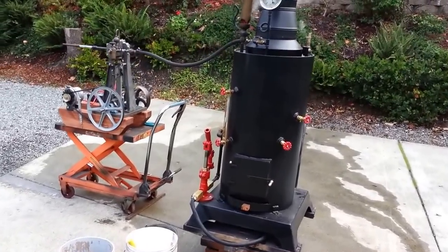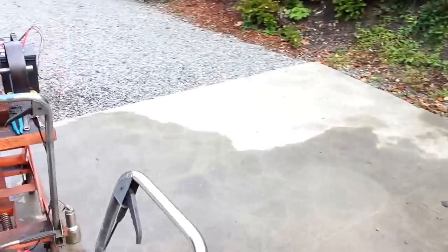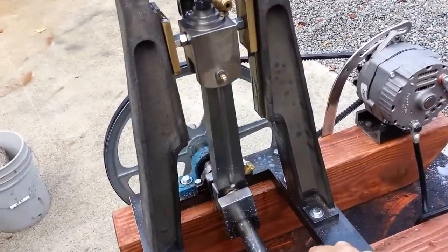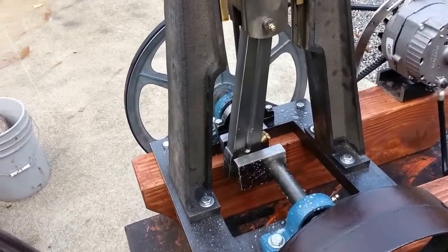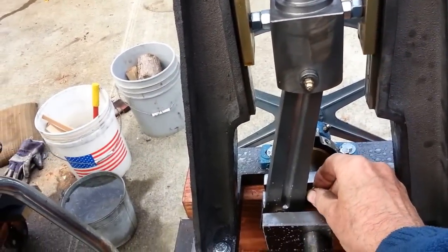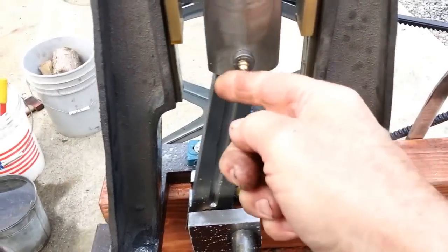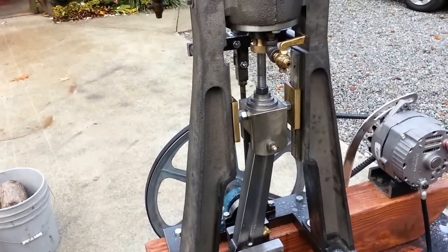Okay Alan, I'm running the engine off the boiler and just going over a couple things on the engine. The single-cylinder engines start best if the crank is sitting about like that. There are grease points here — you just screw that in. Grease point here and on the bearings of course, and I've greased them. Everything looks good.